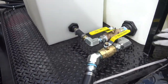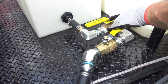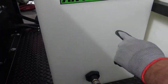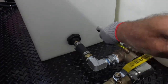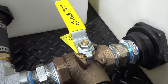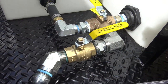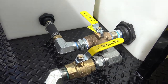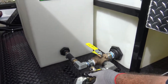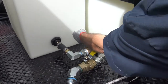We've got our ball valves here — a two-way ball valve. You've got your tank water right there showing the flow coming through. If you want to antifreeze, you're going to flip that and now you're antifreezing, with the flow showing that. This valve right here is only for when you want to work on it, so you can shut the water off to work on the pump. You're going to flip that off. Other than that, you always want that open so you have your water flow going.